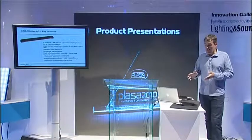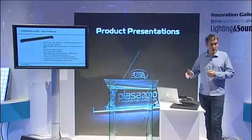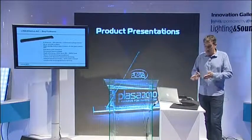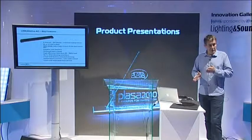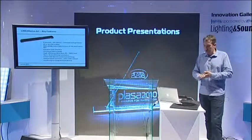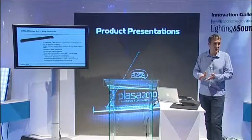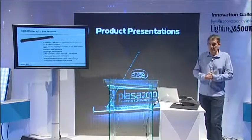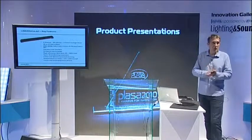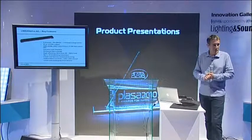But we've done a lot of work to make sure we've got high efficiency across a wide load range. So if we say 100 watts of LEDs, you will get 90% efficiency driving it from 50 watts to 100 watts, whereas some of the other LED drivers are as low as 65% efficiency. But some people, particularly in entertainment-type markets, don't look at energy efficiency as much as, say, in white light applications where we're trying to comply with regulations.